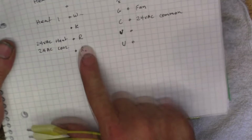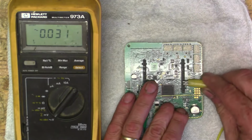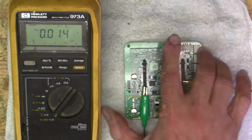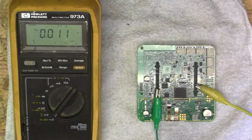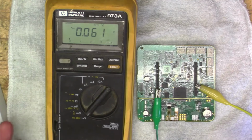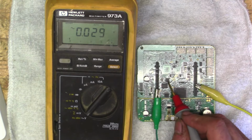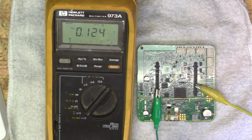So we're hooked up to these two here, and then we want our common, which is 3 up. Hook that up. Nothing, right? So here's a bridge rectifier, right? If you have AC coming in, it's got to come to your bridge rectifier here and be turned into DC, and then it can go through some of these power circuits.